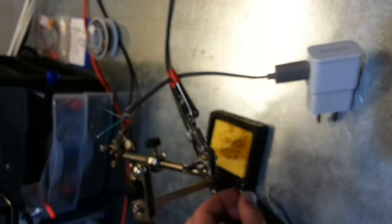If you plug the same cable into the USB port on a computer, it will only pull 500 milliamps or whatever the spec is set up for. So we can build our own cable and have it charge as fast as we want from a computer USB port.